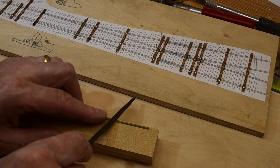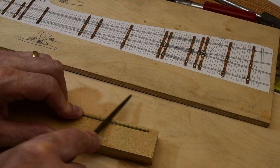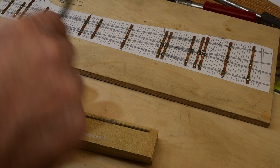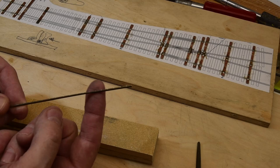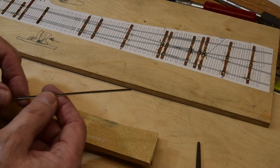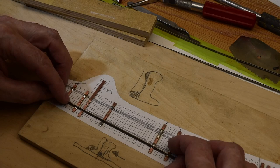And then I just take that base plate on the rail down, file it down for a fair distance. Like it'll show you on the drawing where you see, right? Like you just have to trial and error till you pretty much get it where you want it. It's just a very subtle filing away that you can see it there, see? Okay. And I usually just lay it on there and eyeball it. See if I'm getting in the tolerance there that I want. It's just trial and error, really.